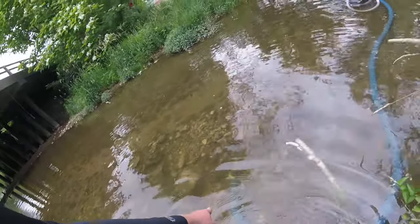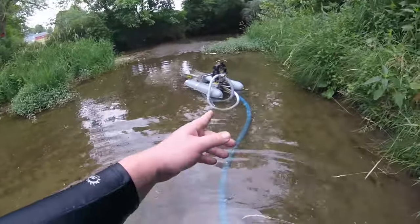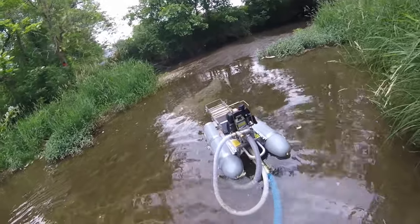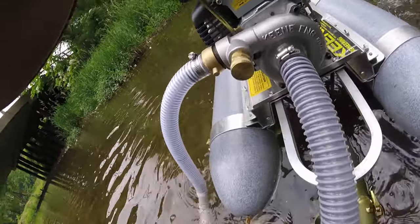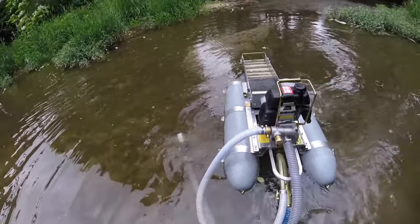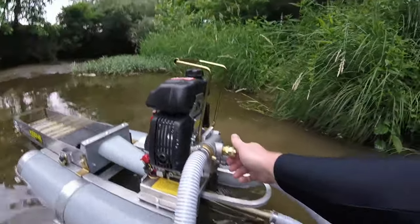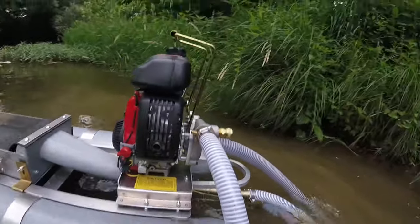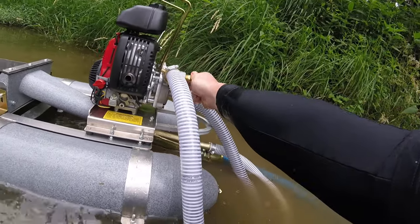So you got your suction nozzle, and that's in a good location. It's underwater. My hose is already filled with water. It's probably already primed from yesterday, but we'll double check that. So the way I'm going to check that is opening up this pressure relief a little bit, and then shaking that, you see this water coming right down there? Means I'm primed.